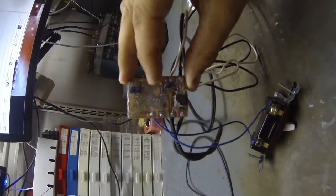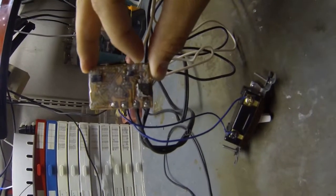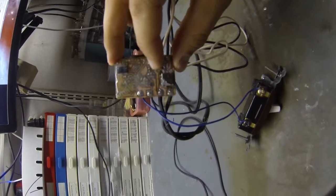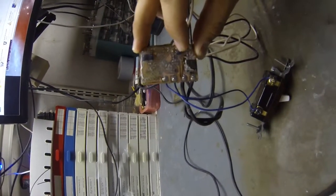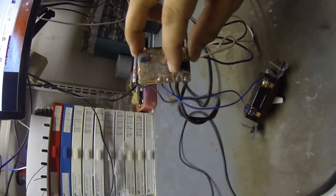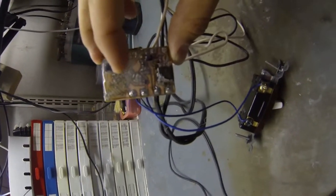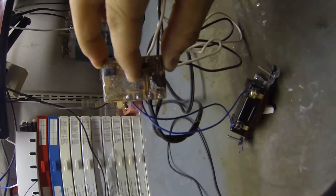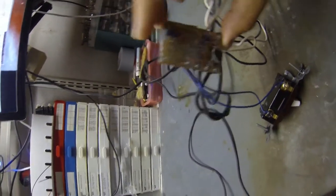There are programming headers and a UART output at 3.3 volt level. The PIC doesn't have enough current to drive the LED directly, so we have a 2N3904 NPN transistor to power the LED for the triac optocoupler. There's a 3.3 volt power regulator on this side with a 1µF stabilizing capacitor. For the MRF24 it needs a pull-up resistor — I could have programmed it into the PIC itself but I put it on the schematic anyway. It's for the SDO line, which is open drain so it needs a pull-up. That's all the parts on the bottom of the board.